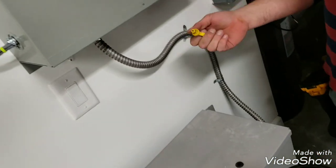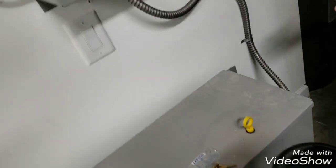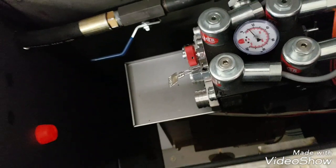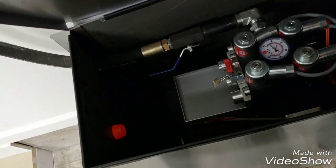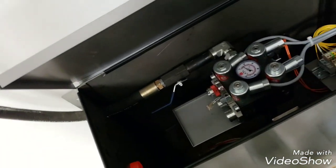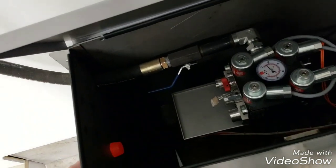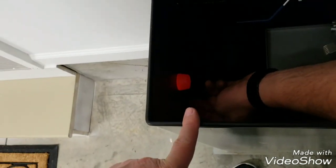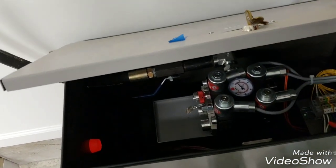Now, is this a dipstick for hydraulic fluid? It is, but they're not really accurate, so we use it as a dust cover — we just plug that hole with them, mainly because these tanks are the same size for all of our elevators. What's that in here? It's hydraulical — this is actually the reservoir. So that's the actual fluid. When it's coming down, all the oil runs back into here and then it pumps out of here. So that is oil right there. Does that ever get dirty and need to be changed? It does not — it never gets hot enough to burn. It shouldn't get dirty. That's why we plug it to keep dust and things out.